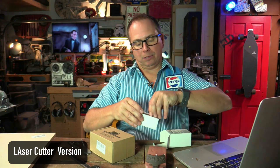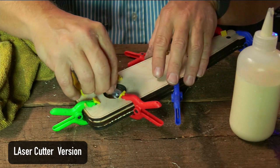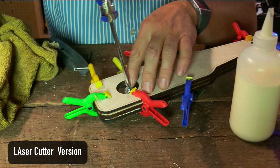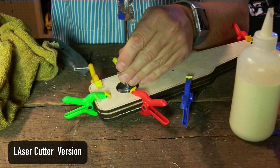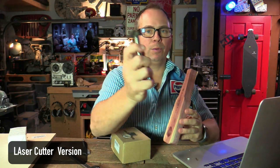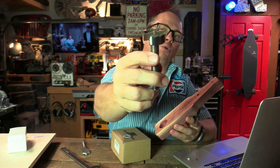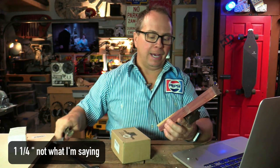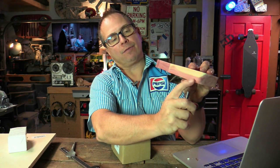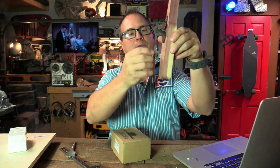Those magnets come with little screws and they're really, unbelievably powerful. The magnets go on the back side of the hole. This hole was the prototype. If you want to do this by hand, you can just take a 1 and 1/8 inch Forstner bit or a spade bit, drill the hole, and you want to go around 1 and 1/8 of an inch from the top. Obviously, you don't want to go all the way through the center — that's the mystery. It holds the bottle cap, and it's pretty powerful.